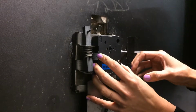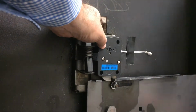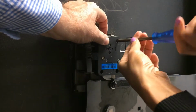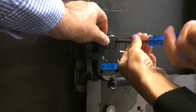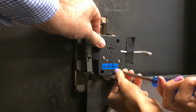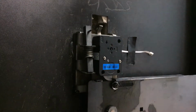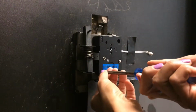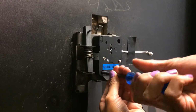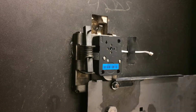That clear plastic tube engages with the hole on the back of the lock body, and we're ready to install the screws. I'll hold it. Now insert the first mounting screw. Then you'll want to do the second mounting screw. And finally, the third mounting screw. All right, with those tight, we're now ready to insert the spindle through the back of the lock body and engage with the dial ring.